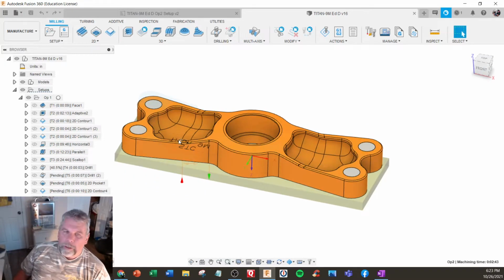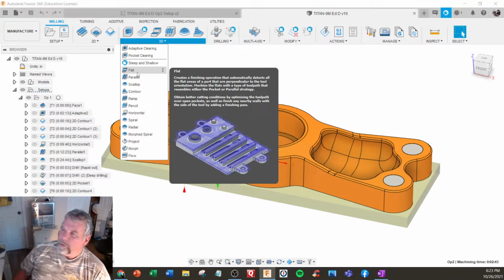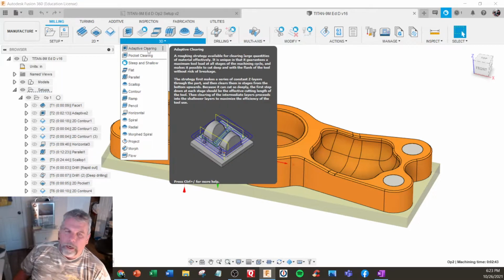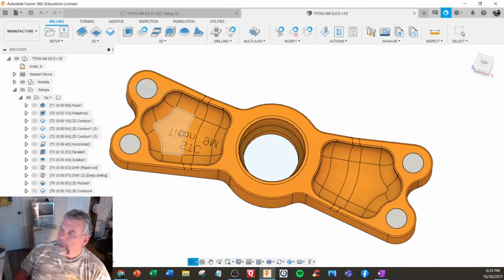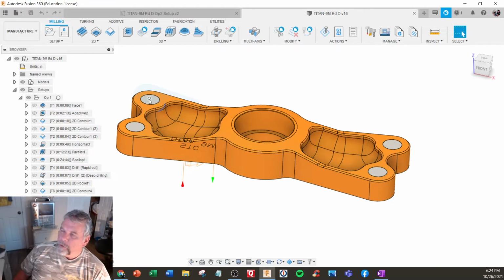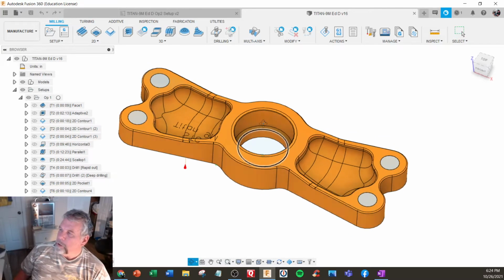So now we're going to get into actually using the 3D area of 3D curves. Most of these will be ball end mill or flat end mill with curves on the corner. So it's really the full purpose of adaptive clearing, the three-axis or 3D area. So we're machining like that pocket. We put little patches over the holes. The rest of this is really 2D contouring and 2D hole.